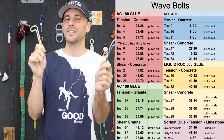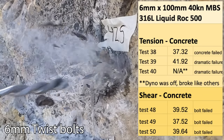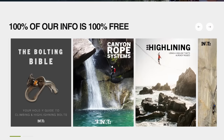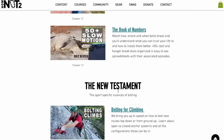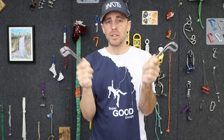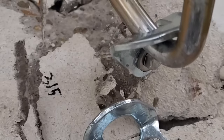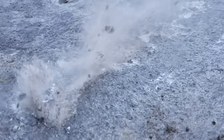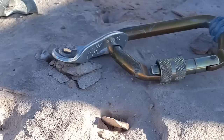Without glue, it took 4.3 kilonewtons to get it out — it kind of just fell out. So that was 30 tests total, not 27, and we got several on the twist bolt as well so you can see how they compare. If you never plan on installing a bolt, I still recommend glancing through the Bolting Bible. If you plan on trusting your life to bolts, please read it thoroughly. Sign up for the emails, check out the store, and if you're curious about another very popular bolt we're not sure why is so popular, go check out our other video.